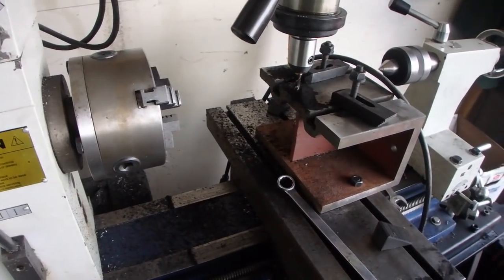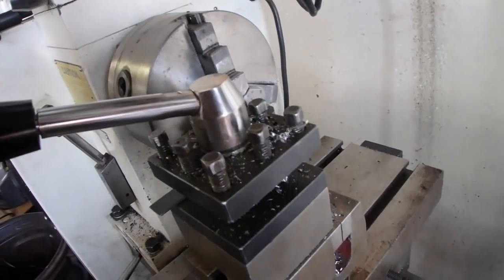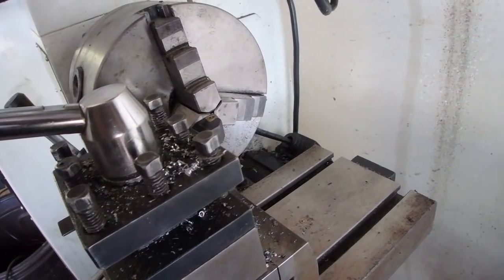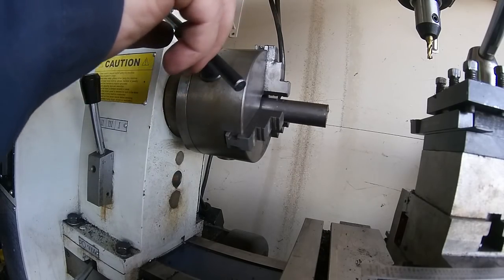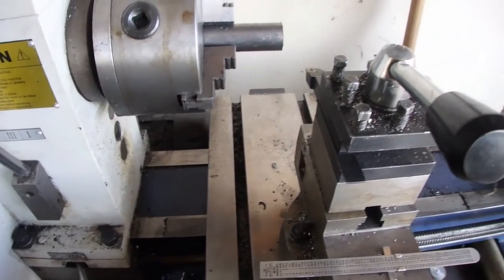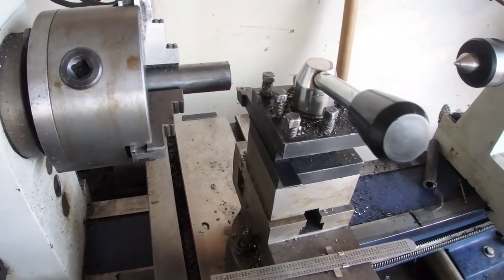First I've got to clean it up because it's still set up for when I machined that hockey puck, which was a failed project. Get everything set up and make sure your cutting bit is as close to center as possible — which we are. The first thing we're going to do is face the end off, which will help square it up.